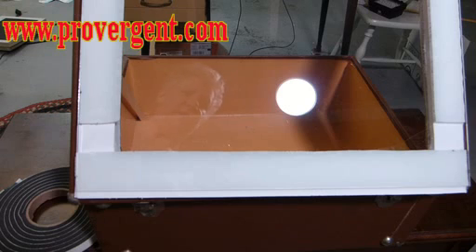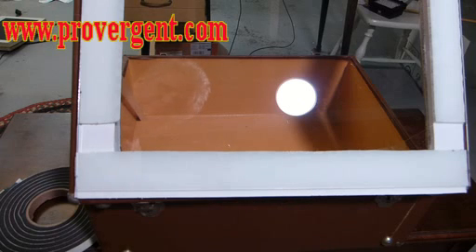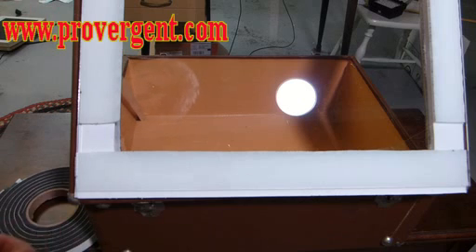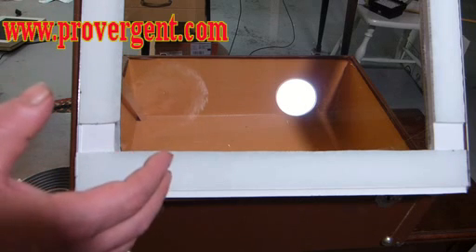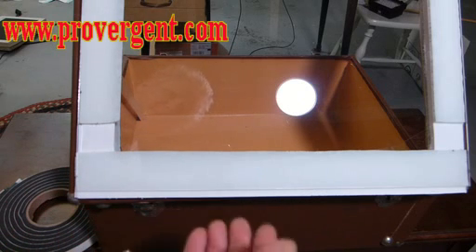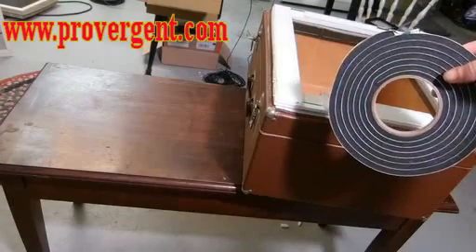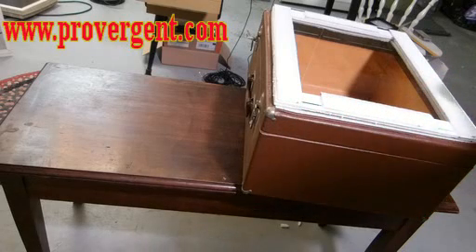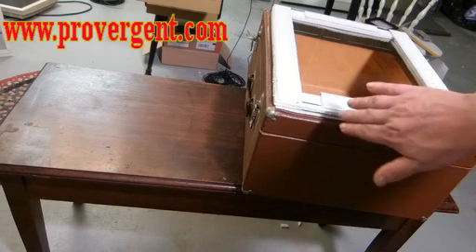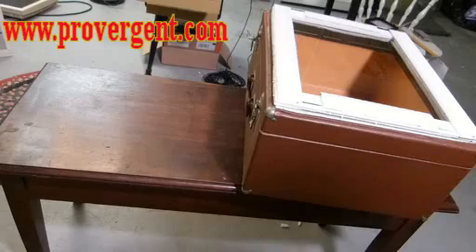Another reason why we put the glass on the outside rather than the inside: if something happens to the glass and you need to replace it, it's so much easier to grab it using the collar built with Velcro and remove it. If you put the glass on the inside, you have to go inside the box and manipulate your hands to the edges of that glass, which might cut you. Doing it on the outside — just grabbing it, pulling it off, replacing it — is so much easier. To protect the edges of the glass, I'm going to use 3/4-inch weather stripping applied on the outside edges so your hand won't contact the cutting edge of the glass. Line it with weather stripping for safety.